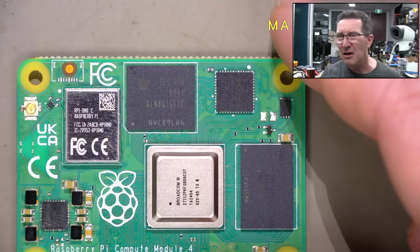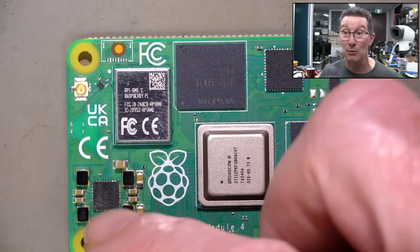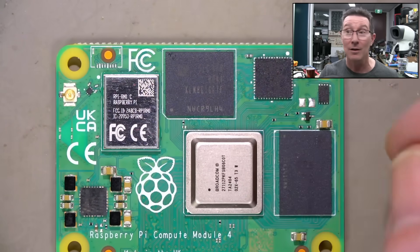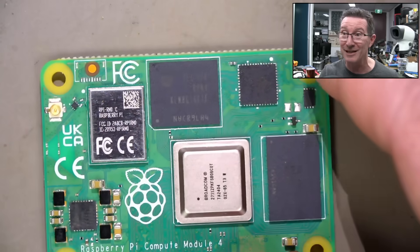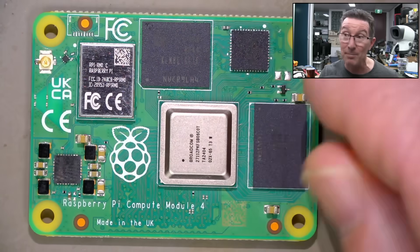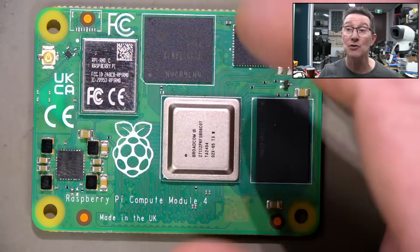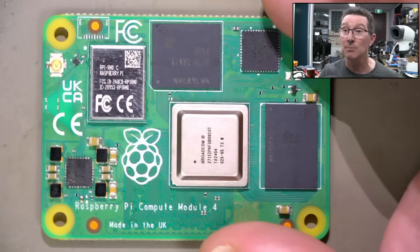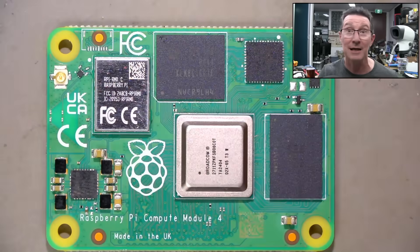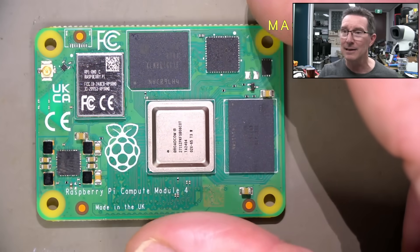There's a small chance this could be loading down the DC power supply, which is trying to push five watts or whatever into that poor little Ethernet chip. That could be dragging the supply down, which could be stopping the processor from booting. So it's quite possible that if we remove the chip, we'll get no Ethernet functionality, but we might actually restore this to being used - it does have a Wi-Fi module, though this unit uses Ethernet, so that won't solve the gateway problem.